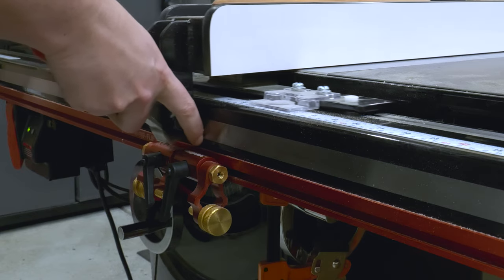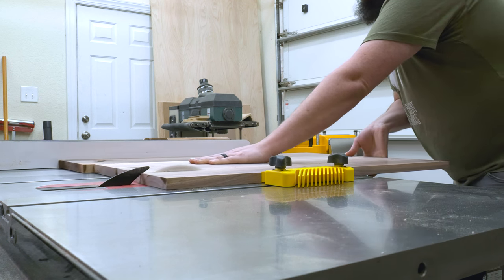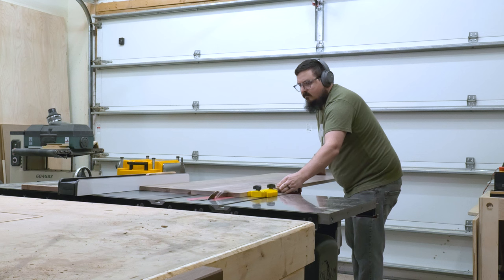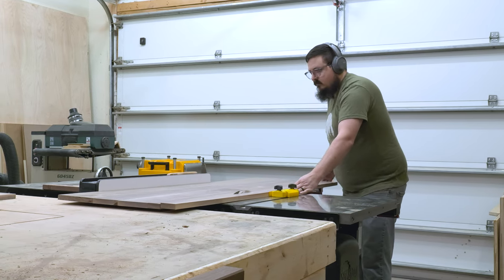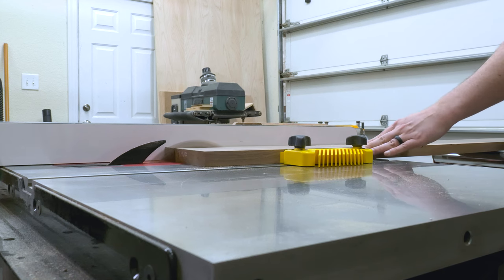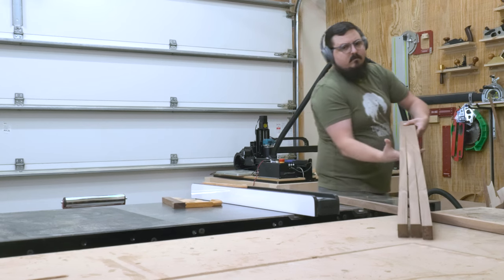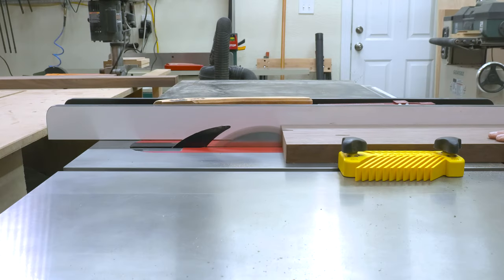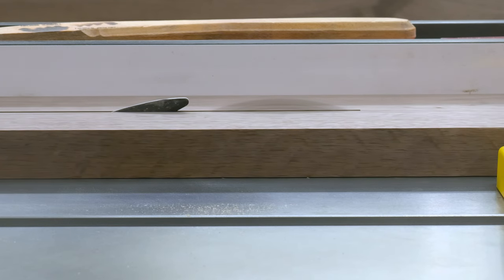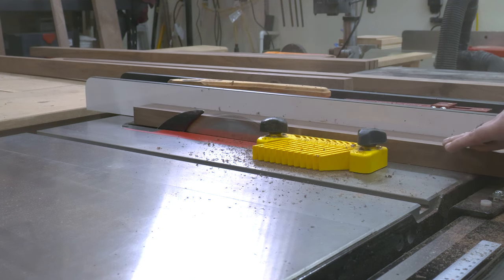I pulled the panels out of the clamps and trimmed them down at the table saw to their final width, then laid out and rough cut the remaining pieces. I'm trimming down the back side edge of the panels, preserving the front edge where I kept the nicer lumber. I definitely recommend using a feather board because it helps keep the piece against the fence when cutting these large panels. From there it was on to cutting the side stand pieces as well as the frame that would hold the mirror. The side stand and frame are where we get into that one inch thick material, which is why I started with that five quarter — these are a bit beefier and should be able to hold the weight.